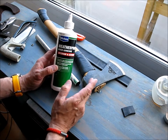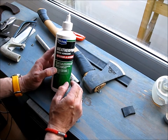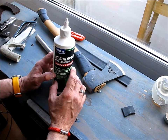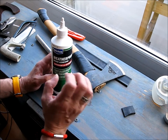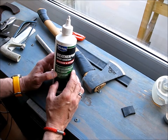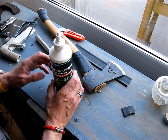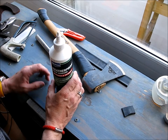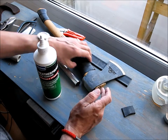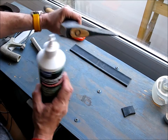I've seen videos recommending linseed oil in there, and I would never do that because it will cause swelling — it gets really tight at first, but it will eventually evaporate slowly and then you risk the head becoming slightly loose. I'll never put anything into the eye but PVA on the top. I think it works pretty well, and certainly has so far.